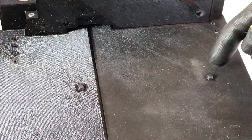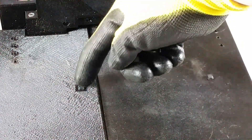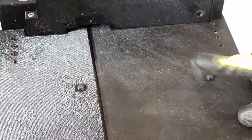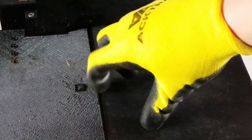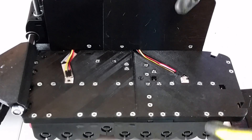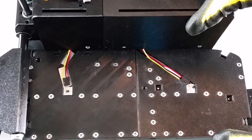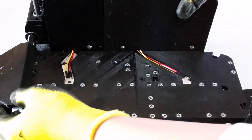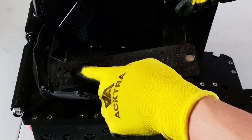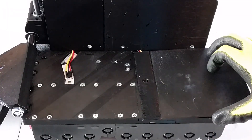The previous design had two buttons on the platform. When they were pressed, the user's foot is on the platform; otherwise the user's foot is in the air. These buttons were exposed on the top of the platform, which means they could get damaged. The new design uses two linear hall effect sensors — these sensors are not exposed, so they won't be damaged. There are two magnets in the binding, so the sensors will tell me when the user's foot is on the platform and when it isn't.